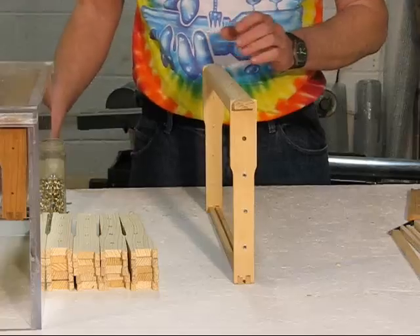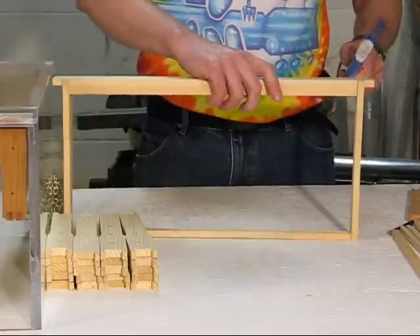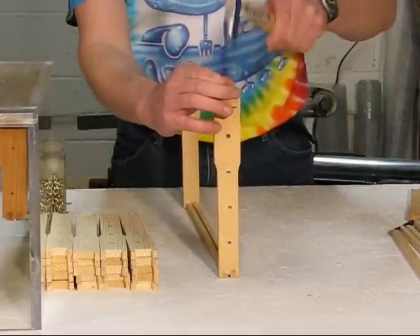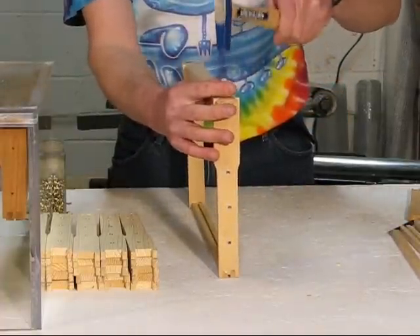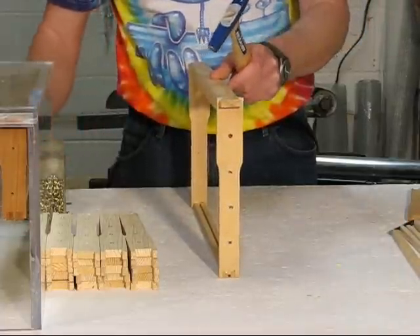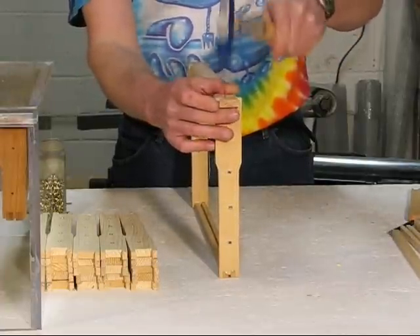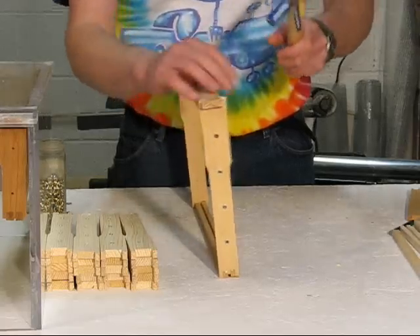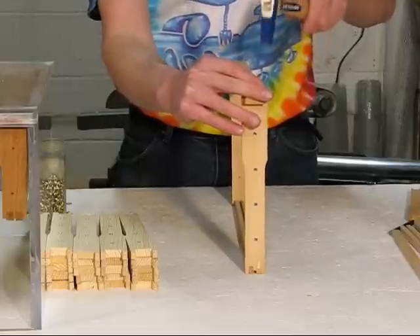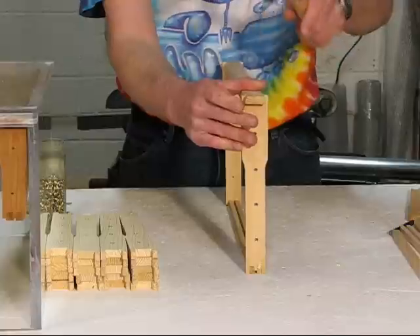Turn it over. It's good to use a small tack hammer when you're nailing the frames — just give it a tap on the top. I like to put two nails in each end, using the longer nails on the top. I haven't nailed frames in a while since I've gone to air staples, but once you get going it comes back quickly. The air stapler is much quicker and results in less bent nails.